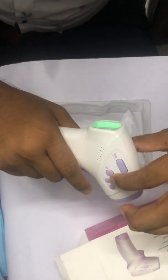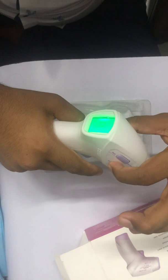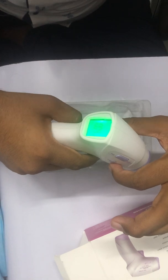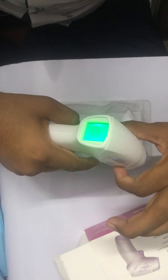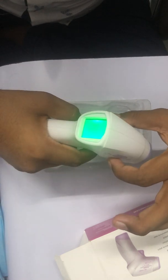F2 mode is for setting the alarm temperature — it sets when the alarm will start beeping. I want to set it at 100, so I'll set it to 100 here. Once the temperature goes to 100, the alarm will start. Set it and press okay.